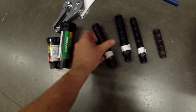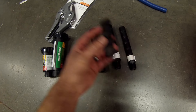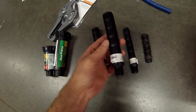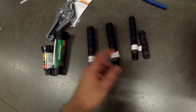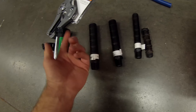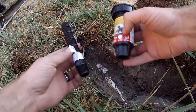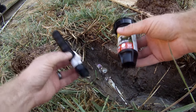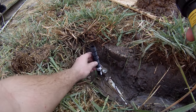If you're not sure what to get, go ahead and remove the riser and bring it to Home Depot or Lowe's, whatever you prefer. The height of the riser is going to be contingent on getting the sprinkler head flush with the level of the grass when you're all done, so keep that in mind. To remove the riser, just grab it with some pliers and do lefty-loosey, righty-tighty just like any other threaded fitting. Once you do a few turns, it will most likely come off by hand. It's got half-inch thread on the bottom that screws right into the T — and as you can see, this is where it snapped off.